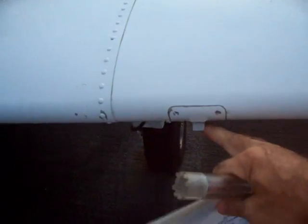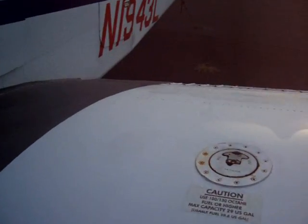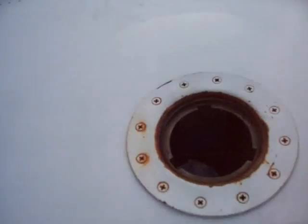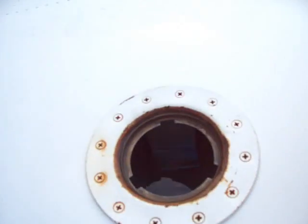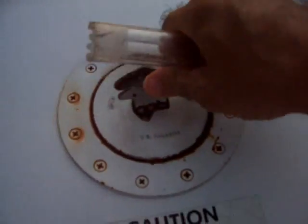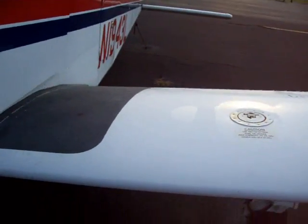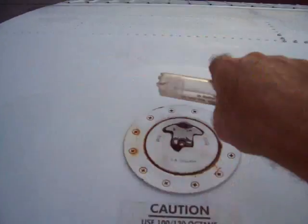Stall horn — pretty good movement, we're good there. Fuel tank — got this up here, take that off. And as you can see it's full of — well, full of gas, not water. Blue, clear. Fuel cap is secure, I'm going to tap on it a couple of times, make sure it's secure.